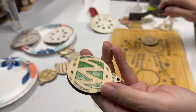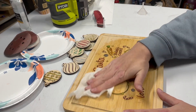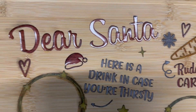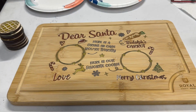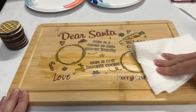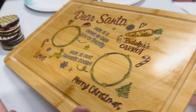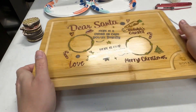To help get some trapped sawdust out, you can use a brush or even some compressed air. Once the surface is free from dust and debris, I'm taking a damp towel and just wiping everything down. Once it dries, it's actually not too bad — the colors are pretty vibrant, and you can see that everything is nicely recessed with the epoxy. Now I'm going to take some food-grade mineral oil and try to liven this up a little bit. You can see how much nicer it's starting to look — it is definitely a bit slippery though.